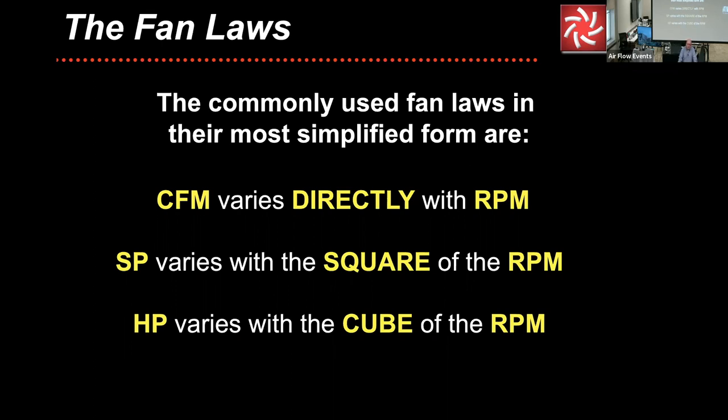Well, once again, you're not changing the ductwork. You've got a reading that sets your lower boundary and you want more airflow. So you're going to have to fan it up, and therefore your RPM is going to increase based upon that specific system that you've taken measurements for, and your brake horsepower. It's not a simple case of going back and looking at the raw data to get more horsepower.